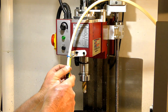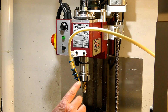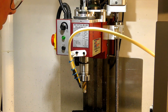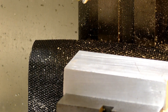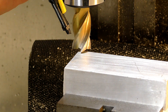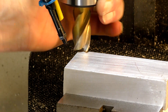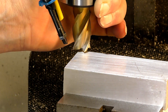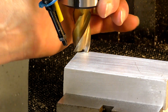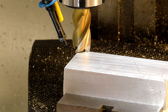With this we need coolant as well, so we'll direct the coolant onto the tool. But first we've got to set the zero, or the Z height, of the tool in relation to the work. The easiest way to do this is to just move the tool — the cutting part of the tool — and just bring it down very, very carefully until it just scratches the top of the material. There it is. So that's within plus or minus a thousandth of an inch, so now we set the zero of the Z in Mach 3.